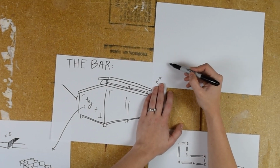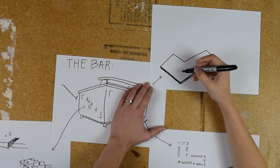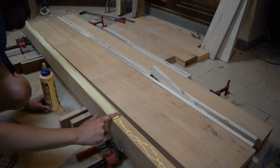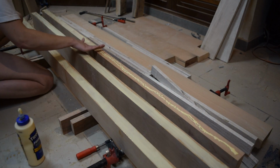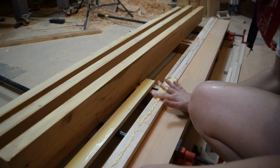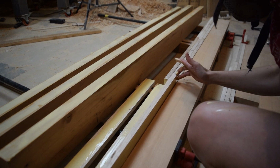On to the countertops. Like the bottom of the cabinet, the first larger lower countertop will be joined by a mitered corner to create the L shape. Let's start by gluing up the two panels of the lower counter. I was close as it was, but I actually misjudged how off square the major boards of this countertop were, and ended up needing to eliminate more width than I originally thought I could get away with. So that butcher block stripe was both a necessity and a happy accident to get the countertop to fit the cabinet.